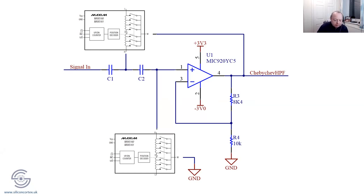I will also say, as a rule of thumb, when it comes to controlling analog circuitry, you need to make sure that if you've got the power supply in the middle, you've got the digital one side and the analog the other side. You don't want to have power and then digital and then analog, or worse still, power supply, analog, digital. It's much better to have the power supply in the middle and then split off the power out. Very often, the power supply is overlooked and assumed to be super simple. So many designs that I've inherited in my career have had no thought at all given to the power supply. It's almost like an afterthought, like product approvals and EMC. And of course, guess what? The thing doesn't work properly, and I see it so many times.